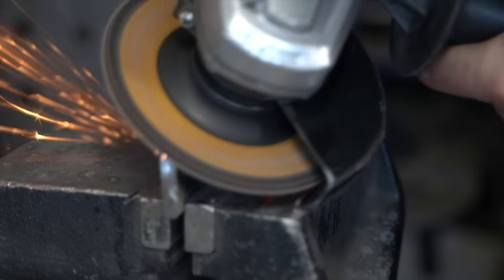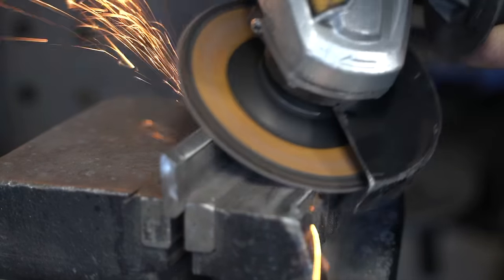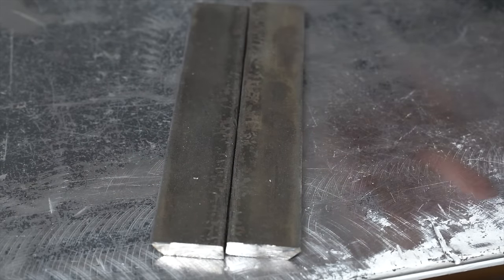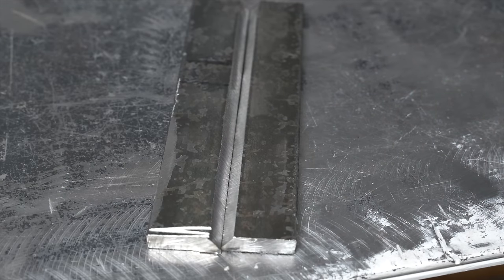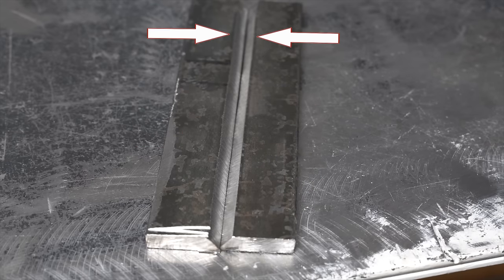We're going to start with a butt weld, but before we fire up the welder, we're going to bevel the edges we plan to weld. A bevel serves two purposes today. The most important: good penetration. If we were to butt two unbeveled pieces of quarter-inch steel, both faces would be completely covered and full penetration would not be possible. The bevels open up both faces, guaranteeing your welds penetrate the entire thickness of your material. The bevel also provides two visible lines we can use to line up our beads uniformly. Stacking dimes of a consistent width with consistent spacing is what really makes a weld look beautiful.